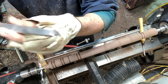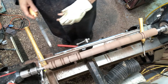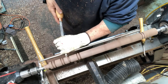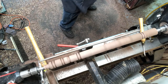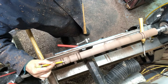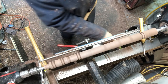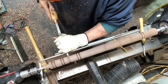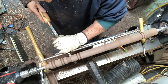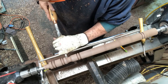I'm using Easy Wood Tools — I believe that is a 3/8-inch circle cutting bit — and this just works real well, swinging back and forth. The trick with these types of tools is to make sure the handle and the blade are parallel with the floor and the lathe bed. You don't tip it down, you don't tip it up — just keep it parallel with the floor, with some smooth gentle rocking motions, always cutting downhill. You can see those pencil lines — those were the lines where I wanted the cove to start and stop.